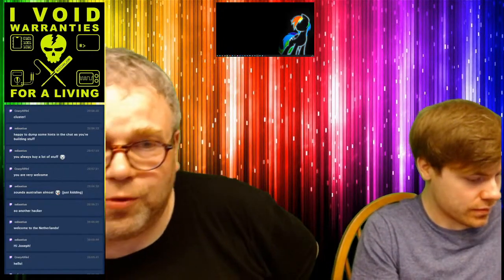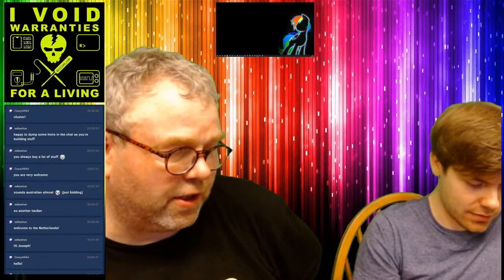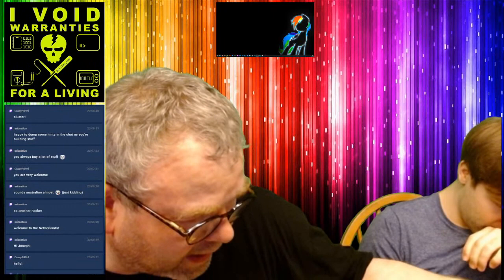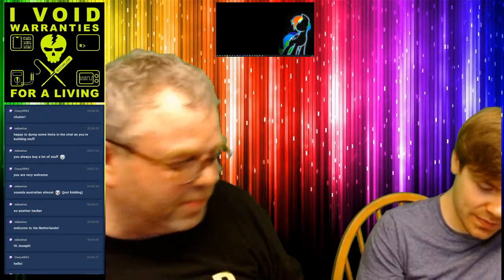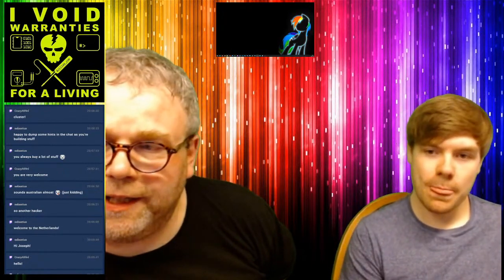But we're using it today to show how to set up MQTT, how to set up Node-RED, hopefully how to set up Grafana, and how to flash the WeMos ESP8266. So we have a WeMos device, and it already has some I2C drivers connected to it. Doing it all on a Raspberry Pi might be a little bit challenging, but I think it will be fun. So we're going to switch now to another screen.